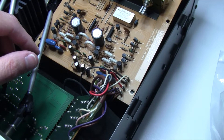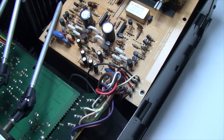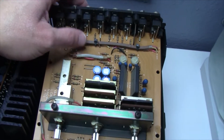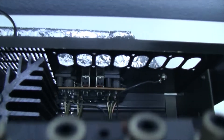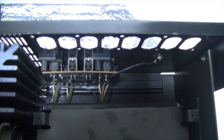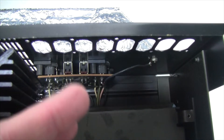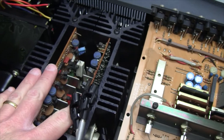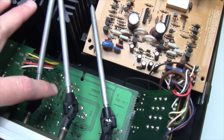I'll see what I'm going to do about that — that's one of the annoyances of this thing. But in principle, I have to disassemble this board to remove those capacitors. And there's the small input board all the way over there; I think there's a pair of capacitors in there — that's the main and the pre, the board that tripped me off. Apart from that, I'll have to remove the two power amplifiers, the ZU, and the tone control board.